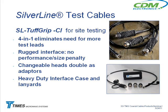Out at the site they need a portable, battery-operated unit. They'll hook up the test cable to the analyzer and then hook up the other end to the transmission line, looking for any problems — they may need to TDR to see where a problem is. A problem they have is they go out there with their test cable, throw things in the back of the truck, and test cables are a little sensitive and can get damaged.